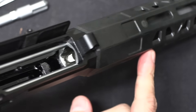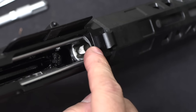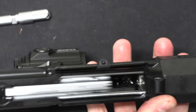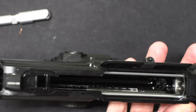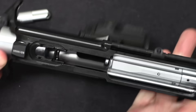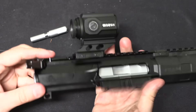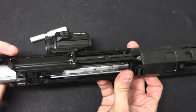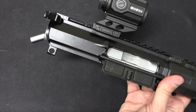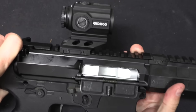The barrel is definitely proprietary to the Mean Arms system because it has this barrel extension with the three locking recesses for the ball bearings. They also have a pair of guide rods in here, which is pretty cool — that's what the bolt carrier rides on. Those guide rods have machined surfaces that the carrier mates up with, and that makes for a really smooth operating system. When I first took this apart I was genuinely very impressed with the manufacturing standards. It's a very smooth operating system, much more so than a lot of the other 9mm ARs I've had the chance to tinker with.